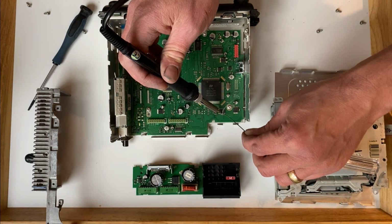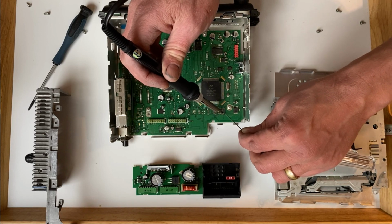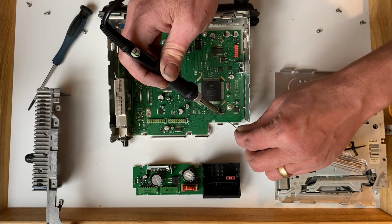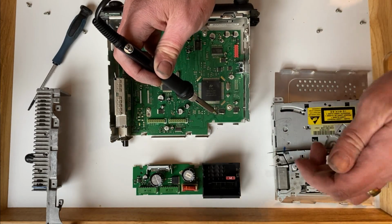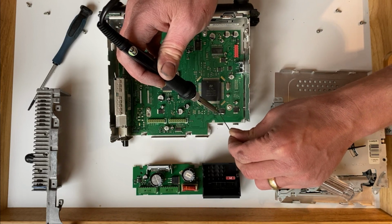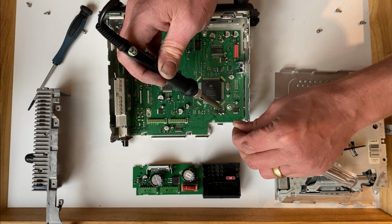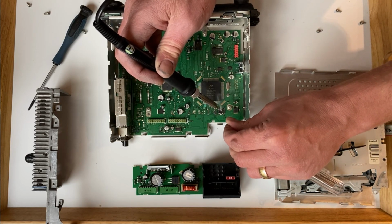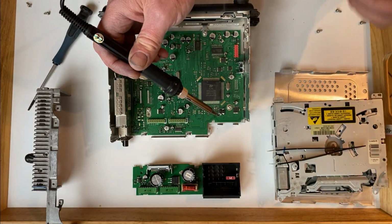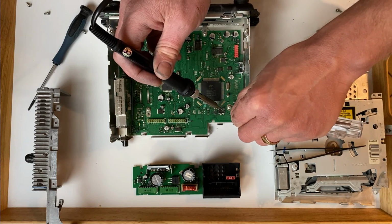I deduced that somehow the stereo had become damaged inside and relegated it to the brick pile. However, whilst doing some investigation into the iBus, I decided it was likely the iBus communication transceiver chip that was damaged. I had a failed cassette player from an earlier Bluetooth conversion that didn't work out and thought I'd give it a go at replacing this chip on my disabled CD player. This video shows the fixed stereo on my desk connected to my development iBus and the chip replacement being done.